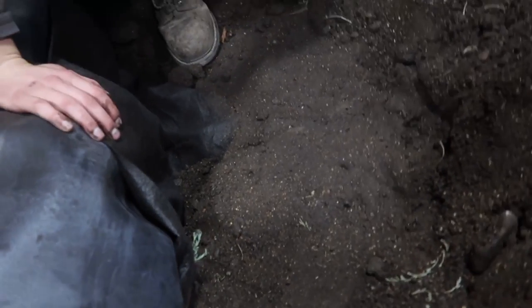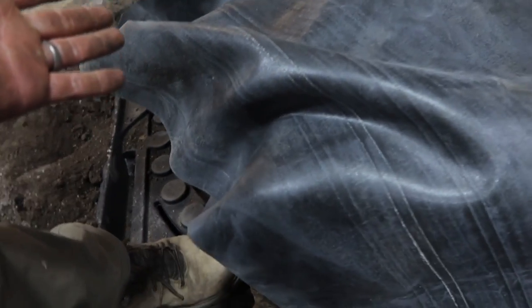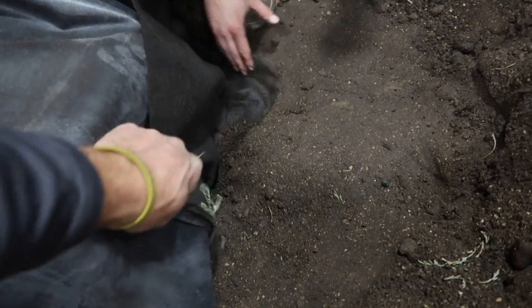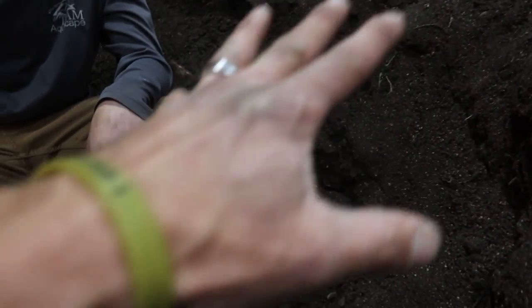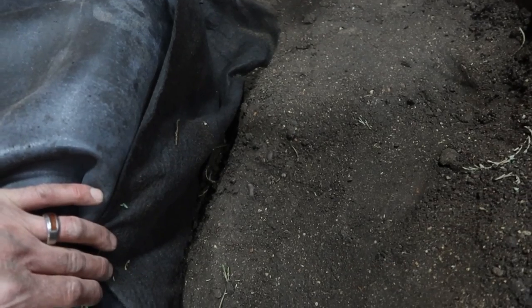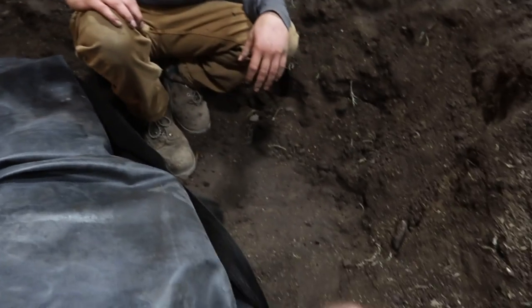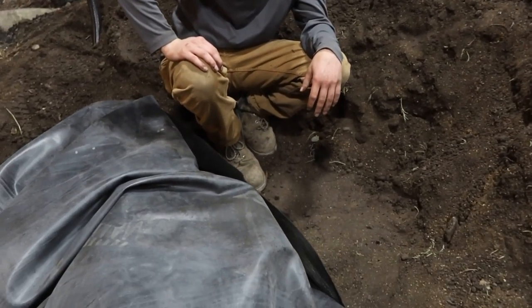So it might be hard to hear us — we are still in a warehouse. The guys have to continue working, but so do we. We've got two of our rocks in that are building a waterfall. You can see we have the liner folded back over the top of these rocks. Here's where that fabric comes into play — that's the corner of the aqua basin right there where Jack's hand is. The reason for this fabric is as we backfill, because we need to bring soil all the way up here and drag it from our berm back down, this will prevent that soil from getting back into the aqua basin on any spot that is not covered by liner and rock. Once you see the finished product, you'll understand how we had to backfill — we had to bring soil in all along the backside through here. That's where that underlayment comes into play and is used.